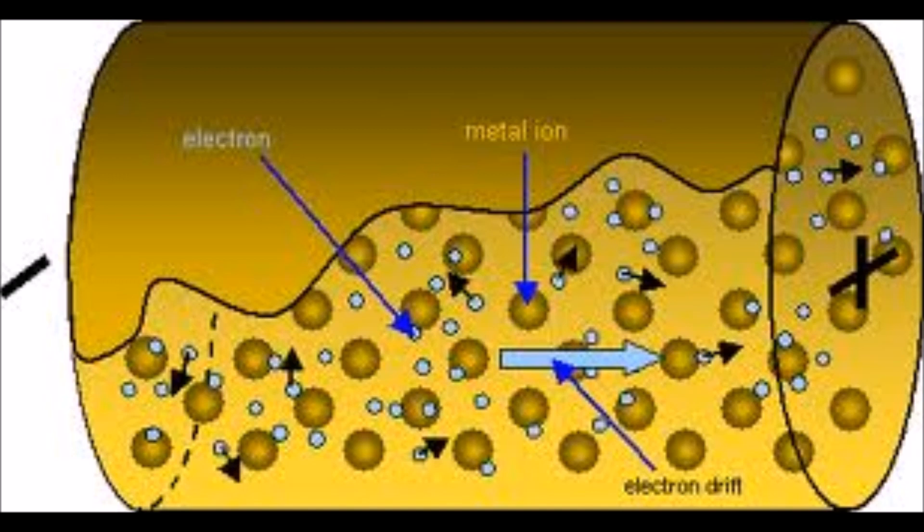The main thing to consider when picking your wire is we want lower resistance. Resistance is something that impedes the flow of electrons through the wire, and the more resistance you have, the lower the voltage will be at the end of the wire. If you have too much resistance, your voltage will drop to a point where your inverter won't be able to work anymore, or your charge controller may not have enough power to charge up your batteries.